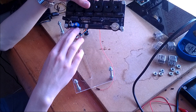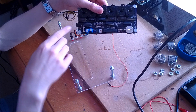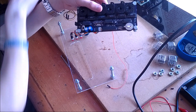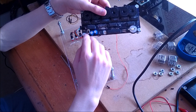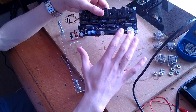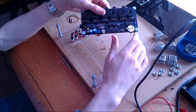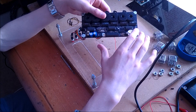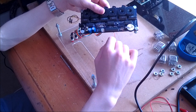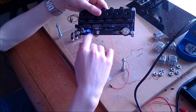On the top side you can see some large capacitors — 470 microfarads — though they're not that big really. The DC input is a 12V 4-amp supply, which is ridiculously over-specced. You need more than 10 volts for the high-voltage power supply, but not nearly 4 amps. The Nixie tubes draw about one or two milliamps each, so nothing here is high-current. I had the supply lying around so I used it. This is a 7805 voltage regulator with filtering capacitors.